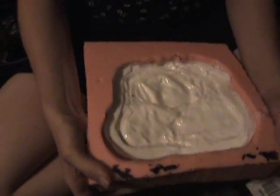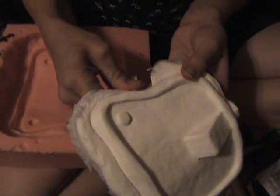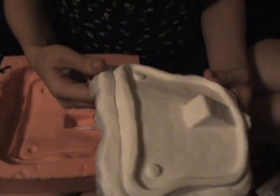Slowly pop your edges first. Okay, so you know it's nice and solid. And then you just peel it back. That's Rebound 25, so it's pretty flexible. And there you go. And all that flash, all this will get shaved off. So it doesn't matter how thin that is, all that will get shaved off. Matter of fact, see how fragile that is? Look at that. As soon as you pull it out, most of it you can pop and break right off because it's really thin.